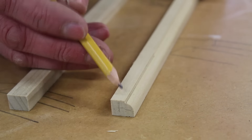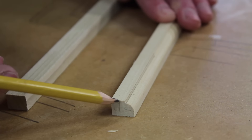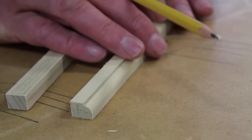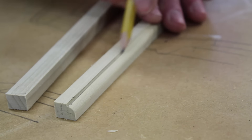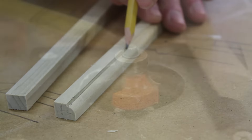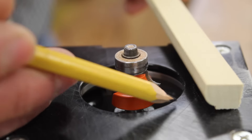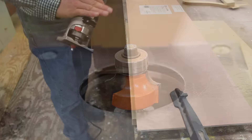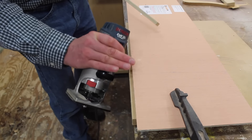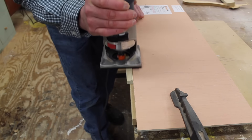This is a piece of molding left over from the project. I started by ripping stock to half an inch by three-eighths, and then I used a roundover bit in the router and set the depth so I'd have a slight flute at the bottom of the molding. To get the flute, I set the depth of the router so the edge of the cutter just gives the molding a little bit of a flute. I clamped a quick jig to the work table, and this will help hold the molding while I push the router along.